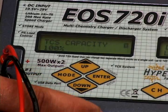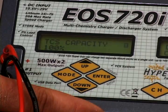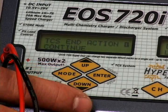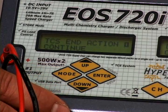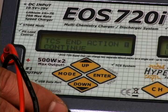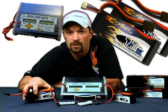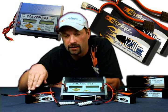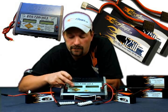Your TCS capacity is the total pack charge. Have that set at 100% — you want to always fully charge the packs. The next setting is your TCS end action. You want that to read 'continue.' Basically what that does is when the charge sequence has stopped, it puts the battery in a hold or maintain state — won't let the voltage go any higher, won't let it go any lower. That ends when you hit enter and shut off the whole charge sequence.